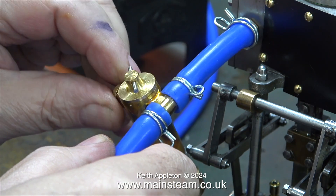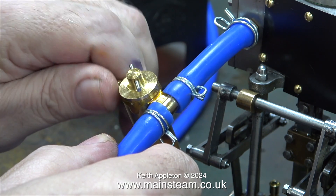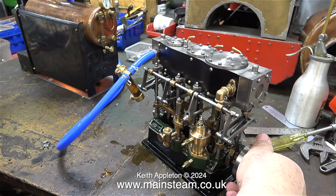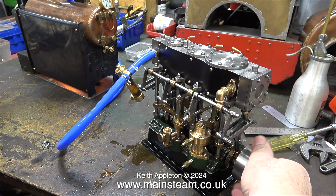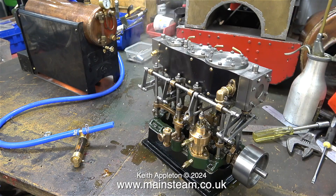In this clip I'm adjusting the oil outlet valve — usually unscrewing the valve one turn works fine. Now it's time to see, after all my hard work, whether it runs on steam. Well, that was a good start. I think I need to make an adapter to fit onto the steam chest, very similar to the one that I made for the boiler. And if you look closely in this next clip, it's clearly visible.